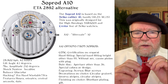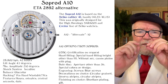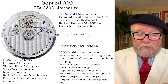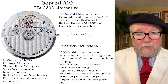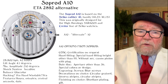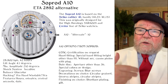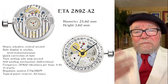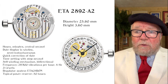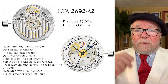For example, on a dial there are these two little posts called the feet — you can see them here — and the feet have to go into certain positions so the dial sits correctly. All kinds of other little details like that had to match, and of course the width and the height had to be identical too. So they made this really good movement that was based on the ETA 2892 with everything the same.